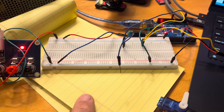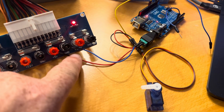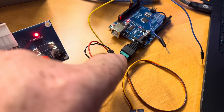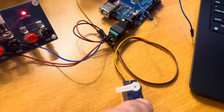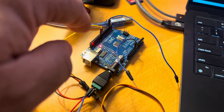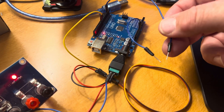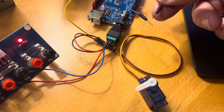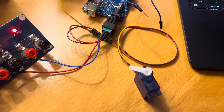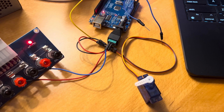Let me just clean this mess up so you can really see how simple it is. There you go — no breadboard anymore. Just a positive and a negative wire, so that would come from your wall, that plugs into there. The servos' plus and minus are getting power from the same place. The yellow wire goes off to the pin I've chosen. The blue wire simply comes from one of the other pins, and the other blue one here is ground. So if I were to join those two together, the signal operates. It'll wait about 10 seconds and then drop down again.